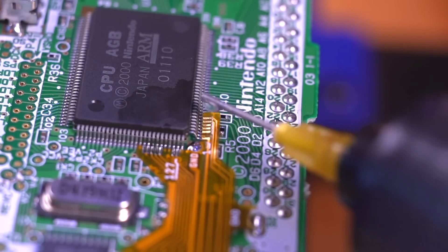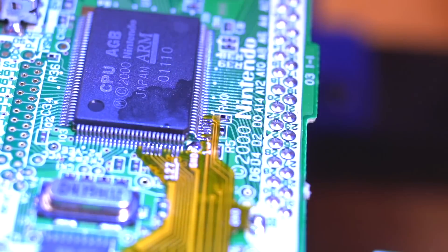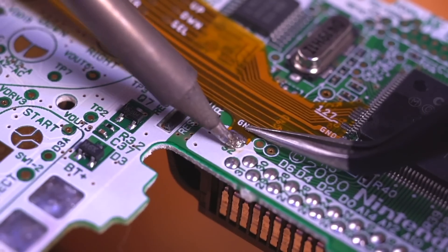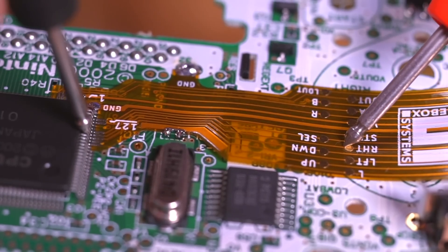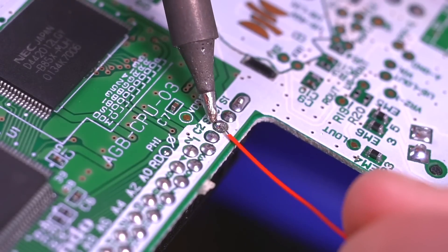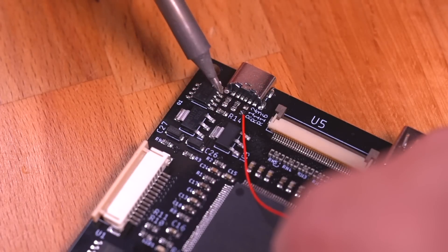Now moving over to the next set of CPU legs, follow the same steps. Here I'm using some tweezers to ensure that the flex cable is flush to the board. Next, we need to solder the flex cable to pin 32 shown here — this will help anchor and secure the flex cable. Then do the same on the opposite side. Helder and GameBox Systems added very convenient pads on the cable so that we can easily check to make sure we made good solid connections. After everything checks out, this is what a fully installed flex cable should look like. Next, we need to solder a wire to the cartridge pin labeled S2, and the other end of that wire to the lower R16 pad on the GBHD board shown here.